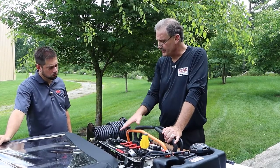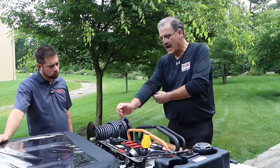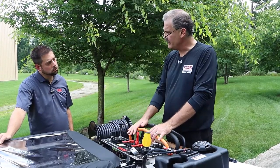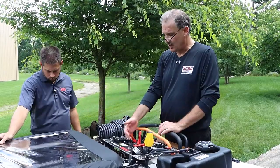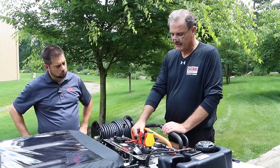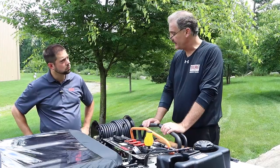As covered in the instrument video, we have the ability to turn the sprayer on, and once our pressure is set, we have three valves right here. The center valve controls the front boom, then we have the auxiliary right-side boom and auxiliary left-side boom. This makes it very quick and convenient to turn off the spray when needed.